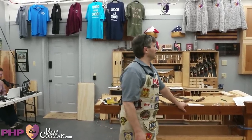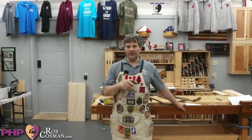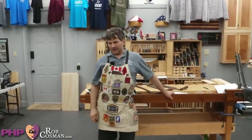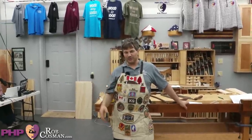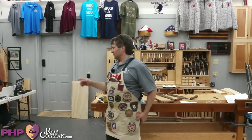Next question: in planning my shop layout, how much real space do I need for my table saw? My table saw is almost centered in the room. Sheet goods are typically eight feet, so you need eight feet from the front of your saw — actually from the blade — and ideally eight to nine feet from the blade in front, and the same eight feet out the back. To the right of the blade you want at least four feet if you're cutting plywood. To the left I'd say five feet. So about 18 feet in this direction, and at least 10 feet in width — 18 by 10 would be the minimum for your table saw space.